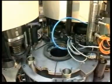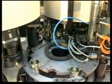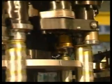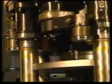The high cones are conducted to a transfer unit between the modules. Automatic monitoring ensures that high cones are not assigned to any workstations which have not received a can body. The seaming lever with adjusted seaming rollers can be replaced as a single unit. This is useful as it allows quick resetting.